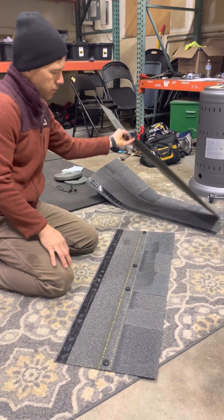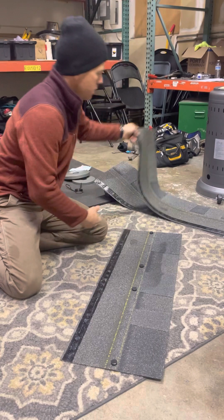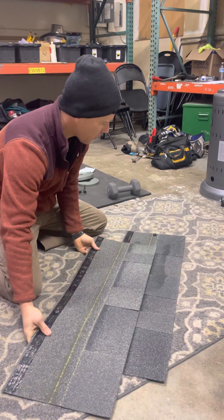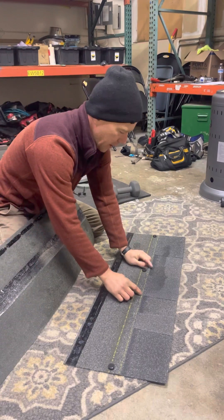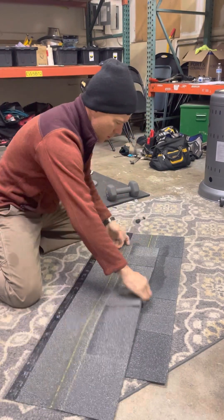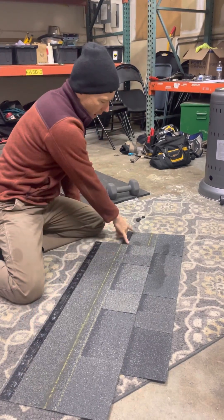Like we talked about in our prior video, when you overlay the next shingle, it goes right on top like that. This bottom edge goes on the water line — that's why we know our vocabulary. It goes right on the water line, not above it and not below it. We don't ride high and we don't ride low. Right on the water line is where you want your next shingle, and you offset it.